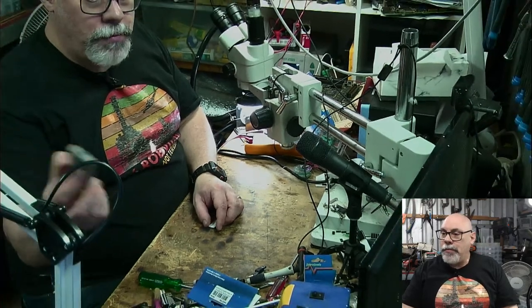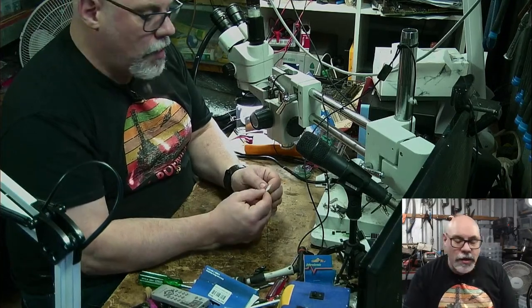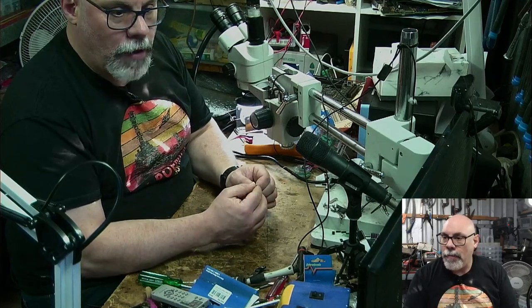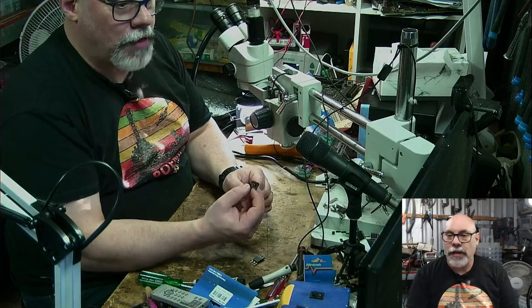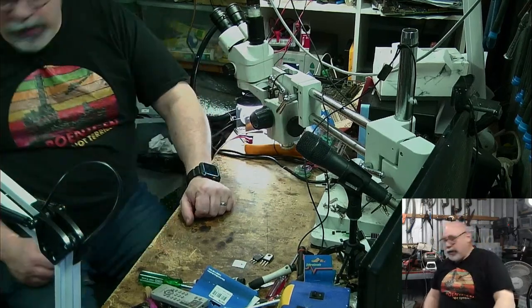Scarlet Swordfish thermal paste there, so these are thermal pads, yeah. Did I say paste? I meant pads. Obviously, I can't use thermal paste on this because when I tighten up the screw to hold it up against the heat sink, it's going to potentially squeeze that paste out, and then I've still got the risk of getting that metal touching onto the heat shield, and I don't want that. It'll make a lot more sense when I actually get the thing out here and pull it apart.